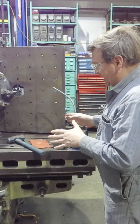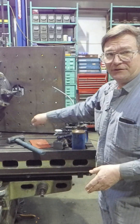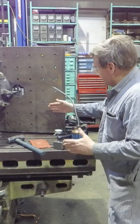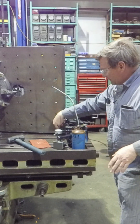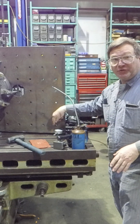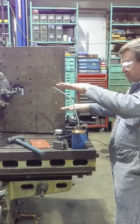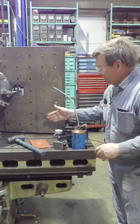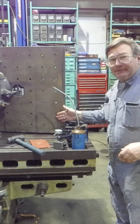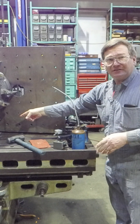The other thing which is really handy — and in all this stuff, you can't have too many dial indicators. If we're shimming up, it's just a matter of how much shim we want to start with under one side, because the other side is sitting solid. But if we're doing an angle across this way where we have a whole plate that we're moving, sometimes we don't have a definite pivot point that it's going to pivot at.